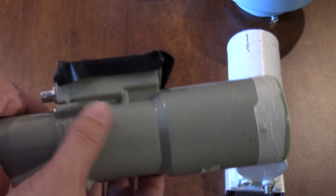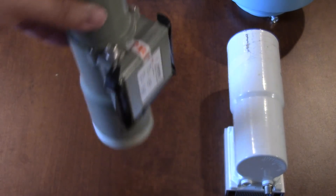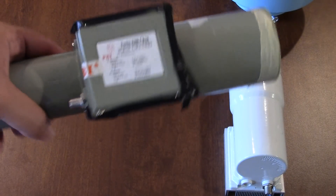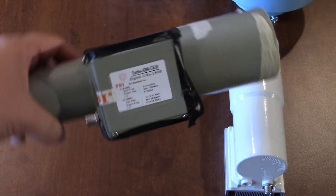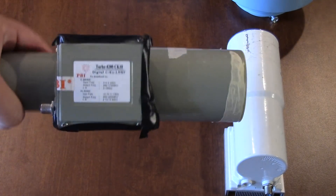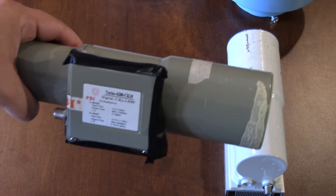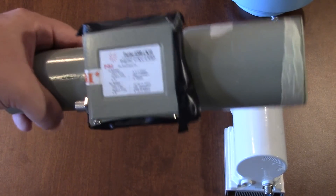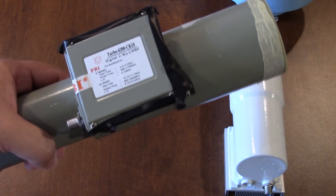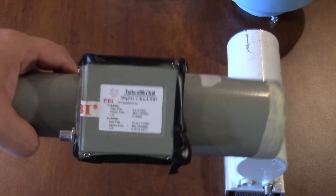I went with the offset dishes and had more luck with C-band. A lot of people say these things don't always get all the KU band and C-band channels. What I tend to do is tune it up to get C-band the best, and if I can get any KU band transponders I'll take it - but I can get some of them, not all of them, so bear that in mind.